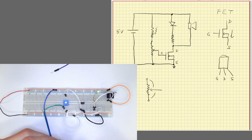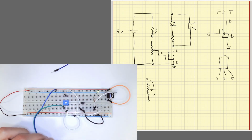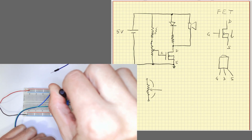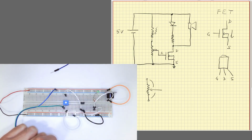Now there's enough light to activate the circuit. Okay. We now can act on this screw in the potentiometer like this. Imagine we are going to eliminate the light and we are going to adjust this screw until we have no sound. Okay, it means that now we have adjusted this one so that the resistance going through this place here is much smaller than the resistance on the other side of this voltage divider, so it keeps this voltage low.